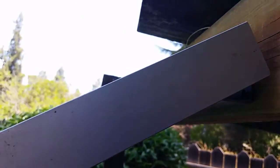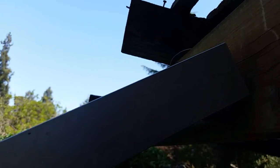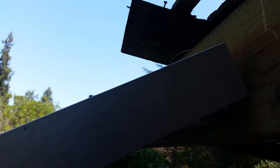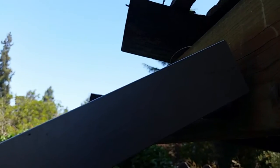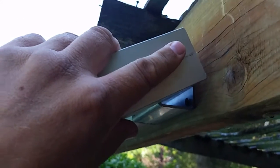The angle of the panel — right now it's at about 60 degrees. I raised it up a little from 50. 50 degrees at Burning Man is about right, but at 50 degrees I can still lift the panel out of the bracket. At 60 degrees I cannot. So I think the magic number will be 60.